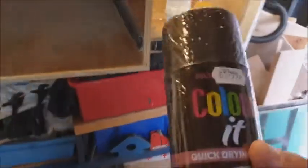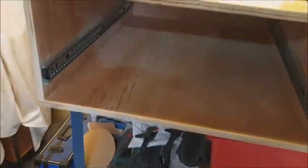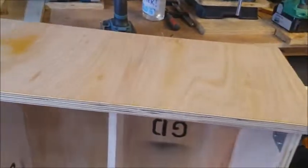everything to seal the wood, because what I'm going to do once that's all sealed, what do I do with it? Right, I bought some of this black satin spray paint. It was £1.99, so I'm going to spray all the outside in the matte black, in the satin black, so the PVA will go on, because if I don't PVA it, the paint will sink in too much into the wood grain and I'll end up using loads and loads of paint.